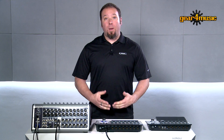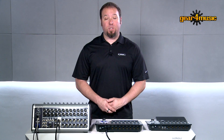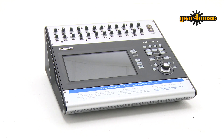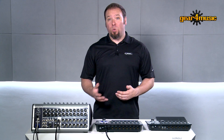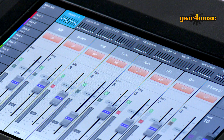One more important feature is that we've upgraded the TM30 Pro to six stereo effects engines, where the TM8 and 16 previously had four, so you have even more flexibility for assigning effects to different channels. Most digital mixers give you only two, and if you get four you have to lose outputs in order to have the processing to run more than two effects. With the TouchMix 30 Pro you now have the flexibility to run even more effects without taking that processing away from any of your aux outputs, so you can run all your monitors and effects independently at the same time.